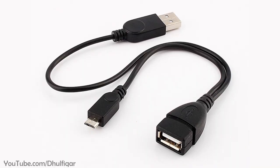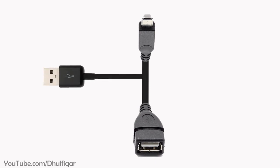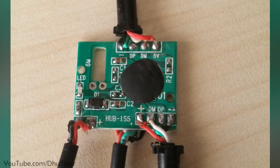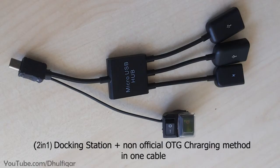If your OTG cable already comes with an external USB power, like this one, then you can skip the step which includes adding an external USB power to the OTG cable. Also, if you have an OTG hub cable like this one, then you need to open it and remove the diode and then short its pads with a blob of solder. That diode prevents the power from reaching the phone and charging it. Do the other side as well so that you can make the cable work with more than one USB port. Thanks for watching.